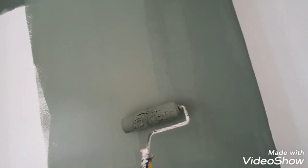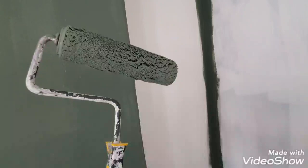These are my go-to sleeves anyway, and this Classic range is no different to the ones I was buying before. I'll mainly use a thicker nap for ceilings, but a medium pile is fine for walls. For rough walls, use the longer pile. I'm definitely pleased with the brush and pleased with the roller sleeve as well.